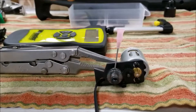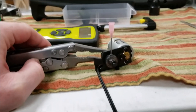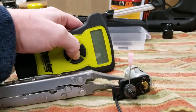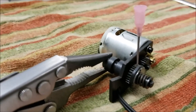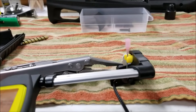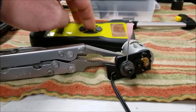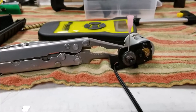You can adjust it to get yourself in the ballpark, which is between seven and nine ounces. You don't need a fancy trigger gauge — you measure it with the clamp down, because it'll just spin if you don't. Pull on the top and you're looking for the clutch to break at about seven to nine ounces. That gets you in the ballpark, then you can figure out if it's too tight or too loose. I adjust it in quarter turns from there.